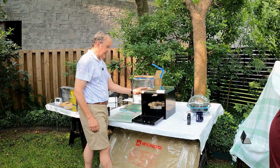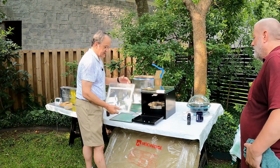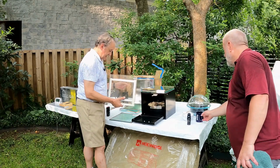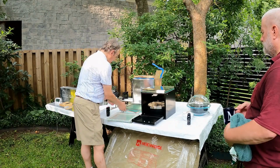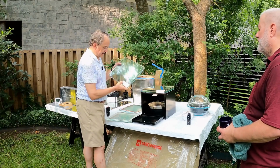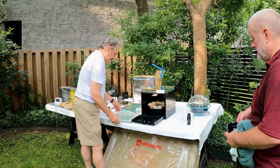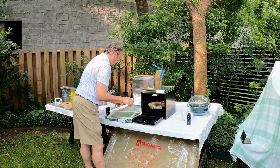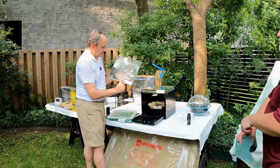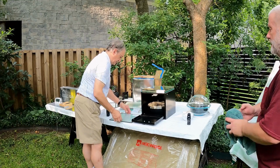So I like this idea very much because the box will be identical, and then I can try different kinds of glass. So as an example, this is the clearest glass I could find. This is actually a 12 by 12 cutting board that I found. And then I had also some clear glass, but when you buy so-called clear like this, this is standard solar band, it says clear, two sheets of clear, but the visible light transmission is only 64%. Again, you can tell it's kind of green, so if you get the ones that are not so green, here's an example. This brand happens to be called Starfire, which is the less green. It's the low iron. So this is 71% going through the 2 of these. So that's better.